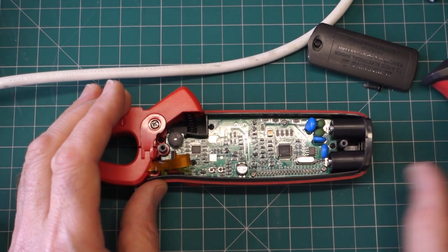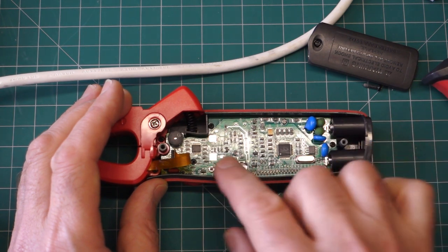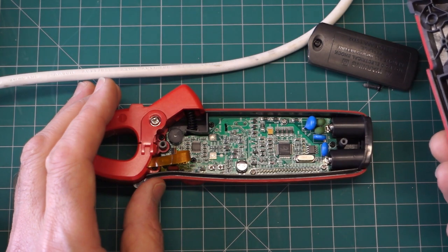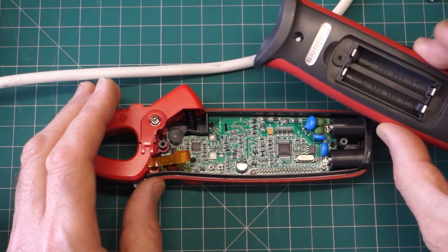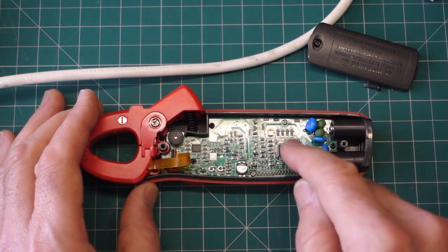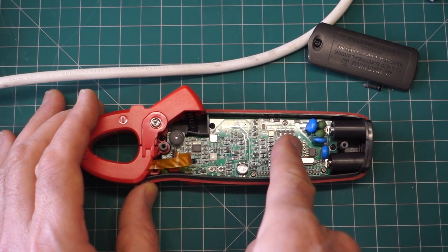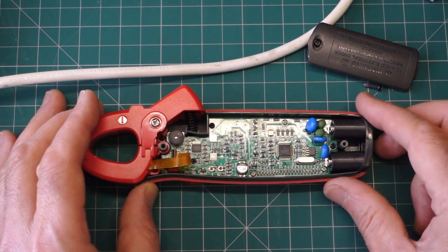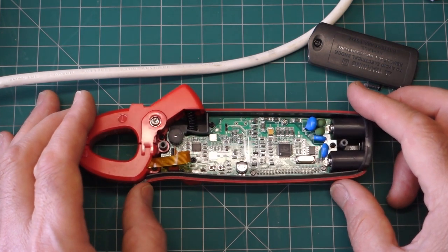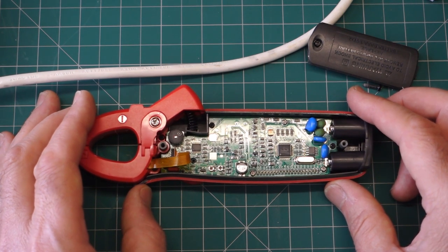What I'm going to do is, because I'm going to be reprogramming this, we need to power the device up, and so I'm going to solder a couple of temporary wires onto there and get a temporary battery box arranged so that we can get 3 volts onto the board. And then we're going to make some connections onto these pins here. And I'll put a link in the description, or possibly put something on the video to show you which connections go to which connections on the Arduino. And we'll do a simple reprogram.